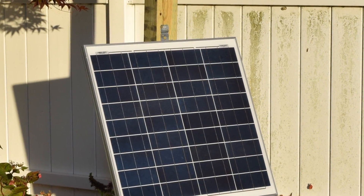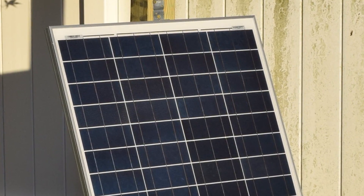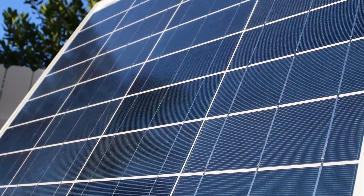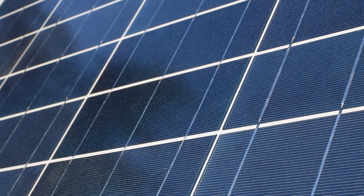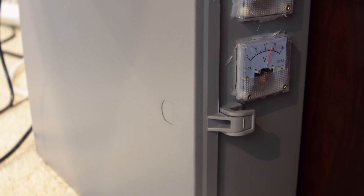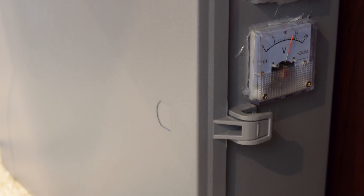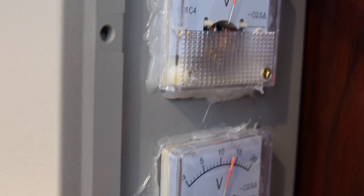I'm going to go ahead and buy another 50-watt panel and mount it to that post before school starts. Right now, the 50-watt panel outside isn't completely charging the battery — cloud cover really detracts from power production, and it's next to nothing when it's cloudy out. Adding another panel would really help fully charge the battery every single day. Because of that, I can't connect my lamp back here to the solar setup with a 20-watt LED bulb, because that in conjunction with the other lamp draws too much power and depletes the battery before the night is over. A quick part three will cover the addition of another panel, which should top off that 20-amp-hour battery every day and allow me to hook up the other LED lamp.